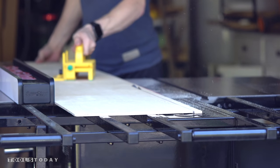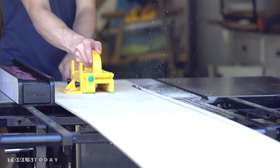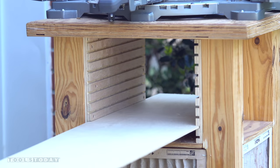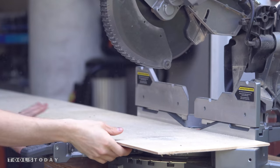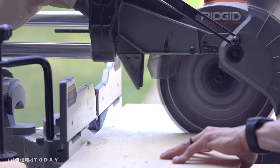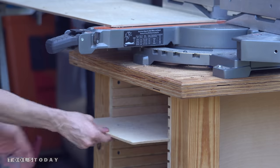Next it was time for cutting the thin plywood. This plywood, as I mentioned earlier, was one quarter inch thick and it was going to slide into the slots. With the miter saw I'm cross-cutting each of the sections down to be the exact length I need to make each shelf, and as you can tell they'll slide in just like this.